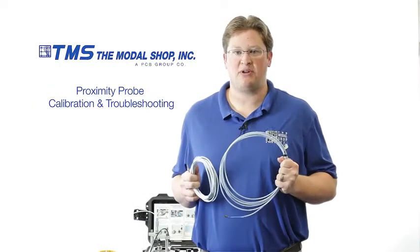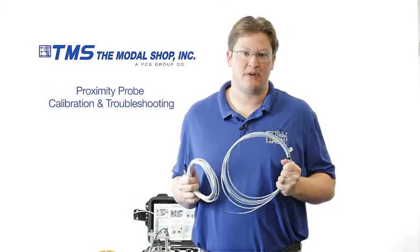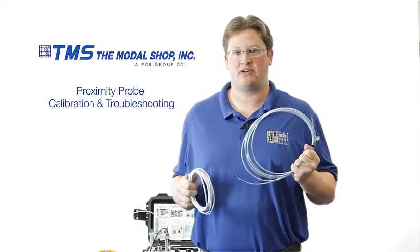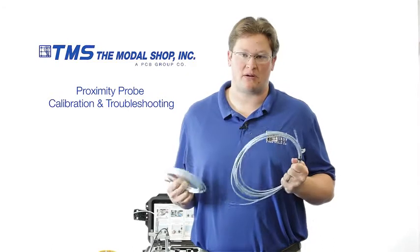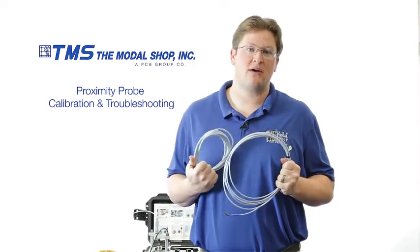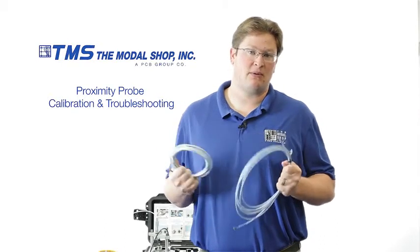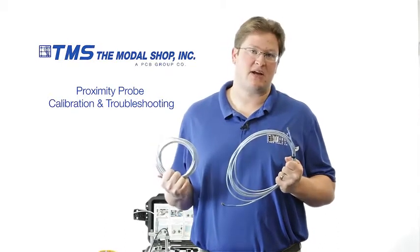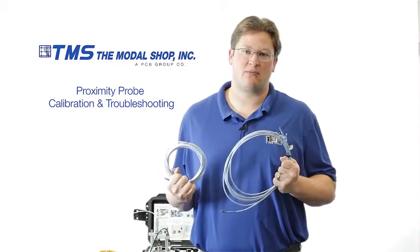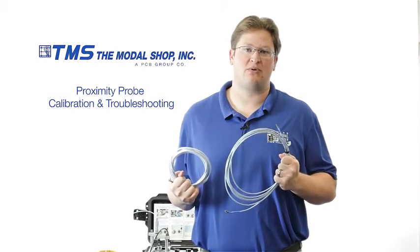You can see how a cabling error can easily occur. This is my four meter extension cable and this is my four and a half meter extension cable. They're the same color — I've coiled my four meter extension cable a little tighter just so I can tell the difference quickly without having to find the model number, but they're the same color and have the same connections. This type of mistake upon reinstallation of proximity probes can affect the dynamic output of the sensor.